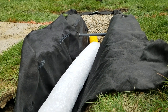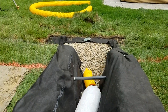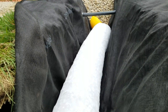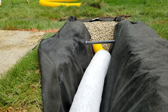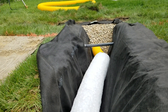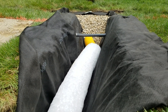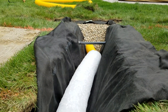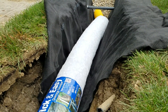In clay conditions they're recommending we use filter fabric — the kind we already use with our stone drains. It looks almost like a screen door, and they say it allows 300 gallons per minute through a square foot. To achieve that, you've got to have pretty much nothing between your poly rock.